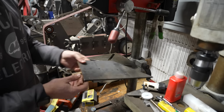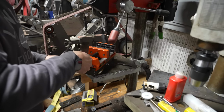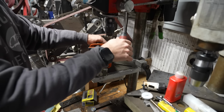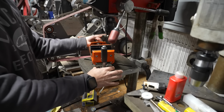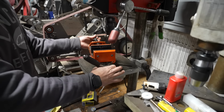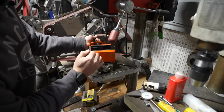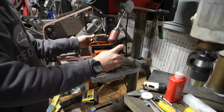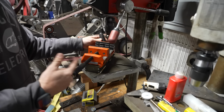But what I've been using lately that I really enjoyed is this fine magnetic base vise. And what's cool about this thing is by racking this handle, you get like a 30% grab so that you can move it around. And then by going all the way over, you get that 100% grab. And I'm moving the whole table when I try to move this. So it's not for everybody. It's not an inexpensive tool. But if you do a lot of drilling, it can be really, really useful.